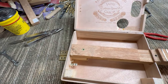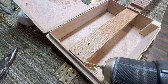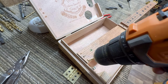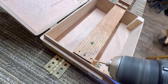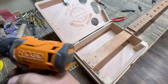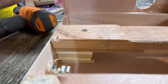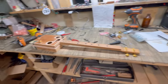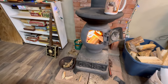Real quick, I just wanted to show you a little trick. These three holes right here are for the hinge, centered. The one closest to the bottom — I just create a little trough for the ground wire to go in, so it goes underneath the box top.